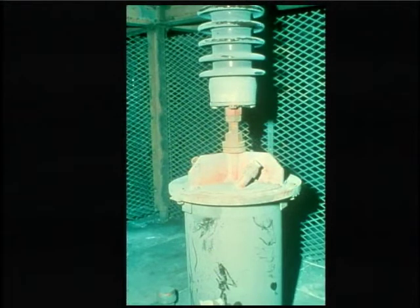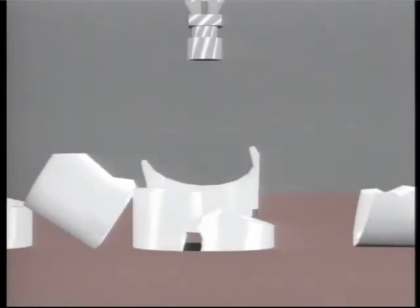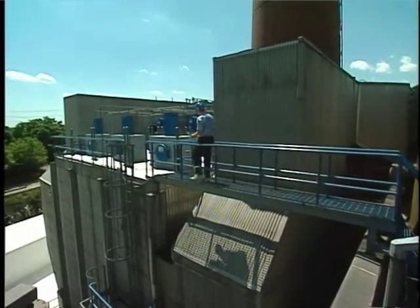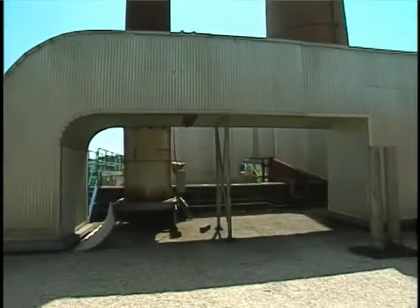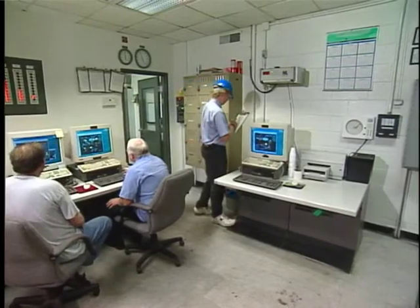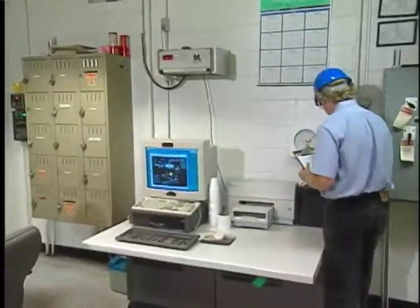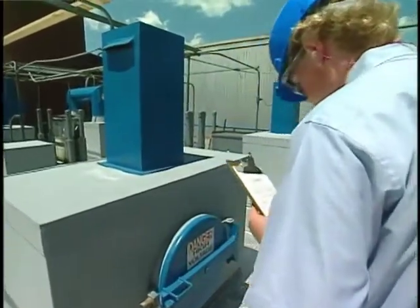Air infiltration into the precipitator can cause frequent insulator failures and corrosion of metal parts because of acid or moisture condensation. One way to identify significant air infiltration is from the gas stream conditions immediately upstream and downstream of the ESP. Increases from the baseline range of temperature drops indicate the need to identify and repair infiltration sites. Likewise, increases in oxygen concentration across the precipitator can be used to identify increased air infiltration. It is also helpful to conduct a walk-around inspection to search for air infiltration sites.